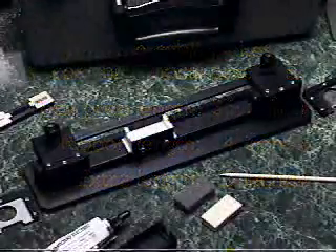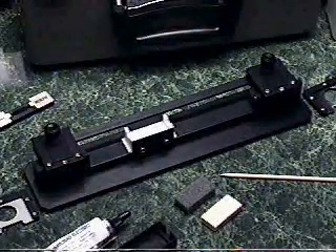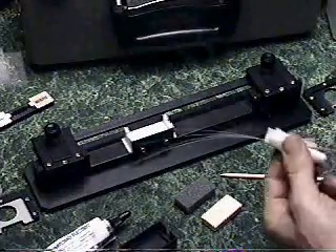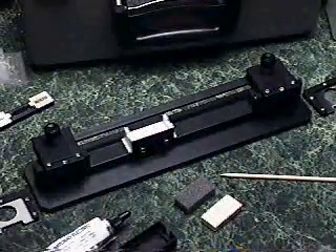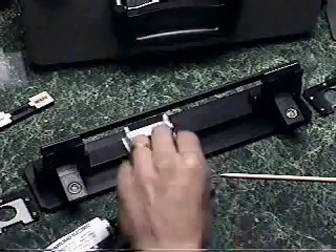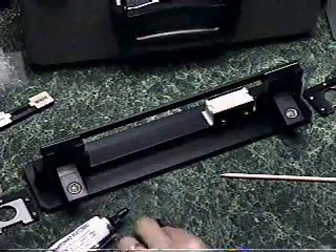The arranger should be oriented with one side toward the cable and with the free fiber ends extending from the other side of the arranger. The shuttle is first located on the cable side. Use gauze wipes and pure alcohol to clean the gel from the unjacketed fibers. Unfasten and raise the fiber clamps to the vertical position. Insert the lower or hard applicator pad in the shuttle and slide the shuttle to the cable end of the unit.